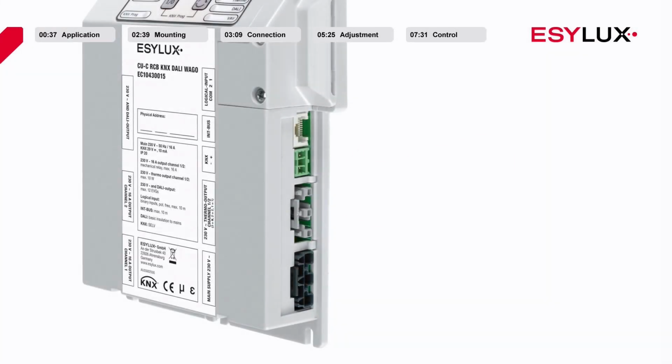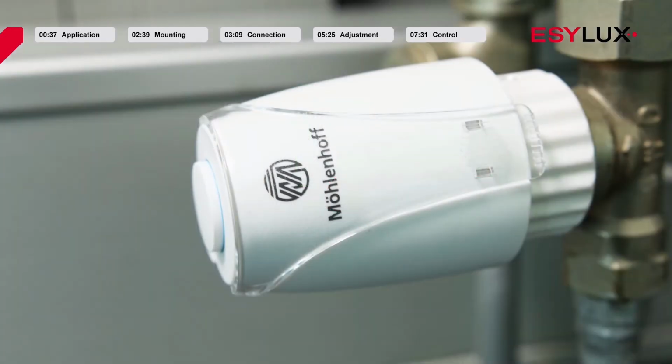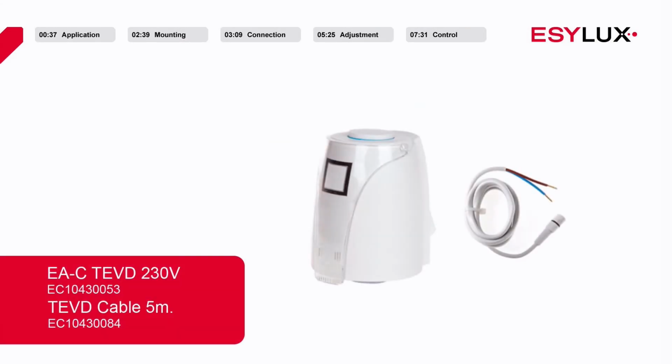The grey connector is the 230-volt switching output for controlling thermoelectric valve actuators. Up to 8 valve actuators on a total of 2 channels can be connected to the room controller box via this connection. These valve actuators can be found in our product range.